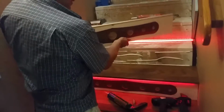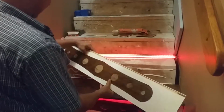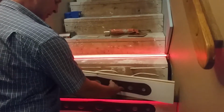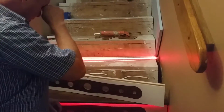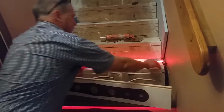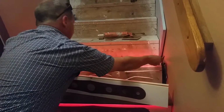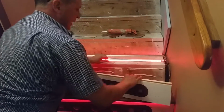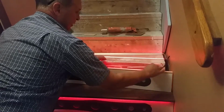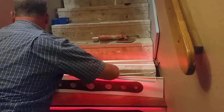We're doing the installation of the stairs, and as you can see, I'm on stair number 5 here. Don't mind that. These are the risers that I custom made on the CNC mill and inlaid the hardwood flooring. I'm first going to put the riser in place, and as you can see, I have this LED arrangement. Trying not to get glue all over. And so I have to tuck the wires. It's really tricky because I have to have the wires behind this when I put this riser in.